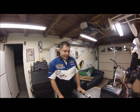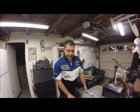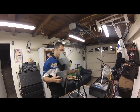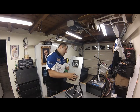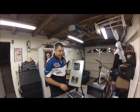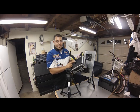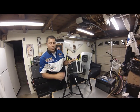We have everything nice and compact for easy transportation and quick assembly. I'll go ahead and put together our ground station as we would if we're out in the field. Start with our tripod for our 1.2 GHz transmitter — we've got the quick disconnect mount. You want to make sure this mount is nice and tight so your antenna doesn't move around in the wind or if it's bumped. Then we've got our ground station tripod. I mounted the tripod quick disconnect mount forward the CG so the tripod doesn't wiggle and the monitor doesn't wiggle while on the tripod.